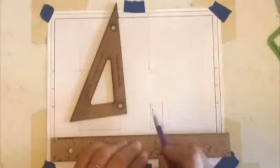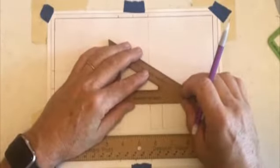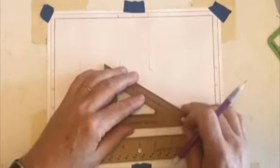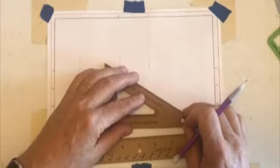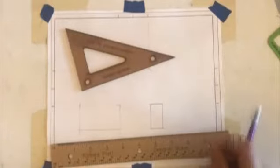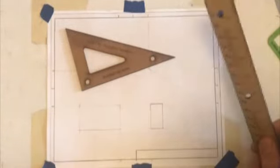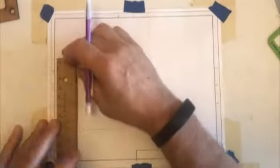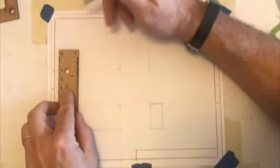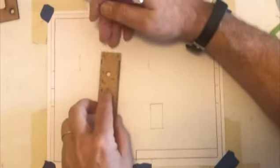I drew that line a little heavier because I knew the parameters of it. I'm going to do the same thing in this view as well — draw that a little heavier. I'll come down here and draw this a little heavier as well. So that part's starting to shape up. We know it's one and a half inches deep, so that'd be three-quarters of an inch. I need to do the same thing up here at the top, swinging around so I can see this better, and lining up to where it would be right on three-quarters of an inch. Make myself a mark up there, slide over to the opposite side and make another mark there.